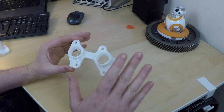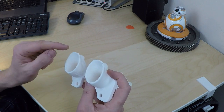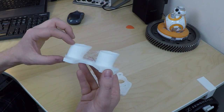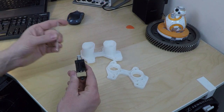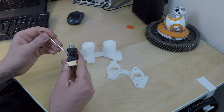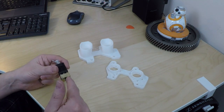So this is the first print I did just with my PTFE settings — you can see some real problems here, a total failure. This is with the one mil retraction — still a failure, with a lot of stringing, but I got a lot further and went through a lot of retractions. So I don't think it's the retraction setting that's wrong. That's about an hour and a half into the print — I think that's more like heat creep. For us to have a clog with only one mil of retraction means it's not melting down at the nozzle; it's melting very close to the cool end. The heat break is getting too hot, which means the cooler is not doing a good enough job — especially on long prints. The retraction was fine; it just got to the point where it couldn't carry on.